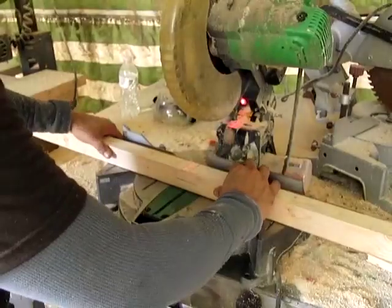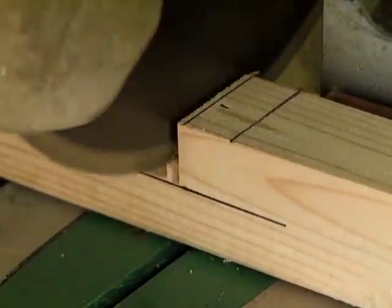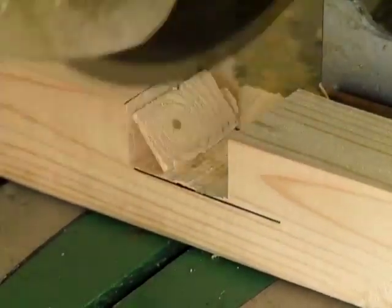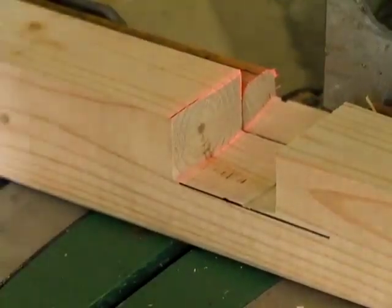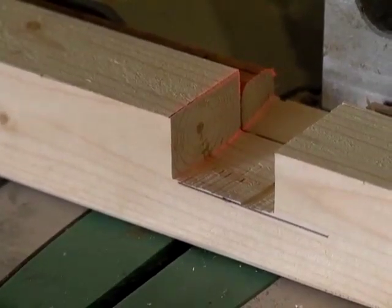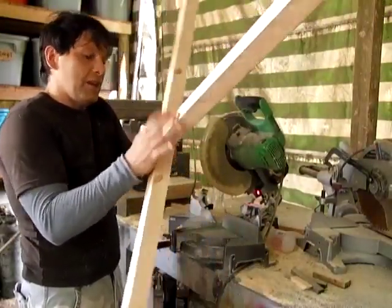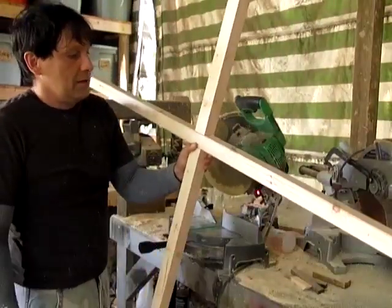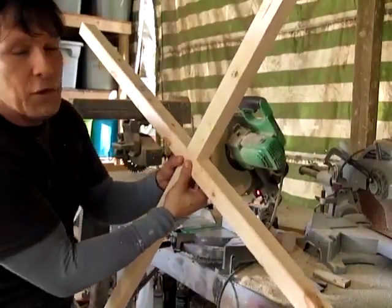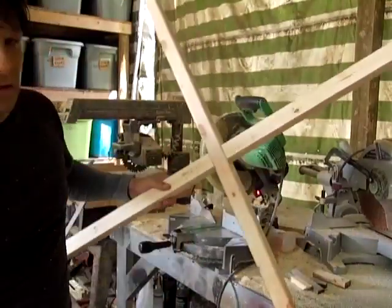We're going to go ahead and line this up, do the same thing over again. So we just cleaned out our second one. I did this in under a minute, so the guy with the DADO blade, he's still changing it. Now you get my point. So now what you have are two pieces of wood that should interlock together like this. If you look, this one's just a touch higher, but it actually is almost perfect. If you want to be a perfectionist, you can go ahead and go deeper, just a touch. You don't have to do that, but these lock together really nice.